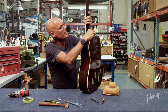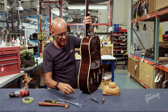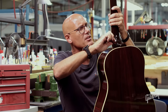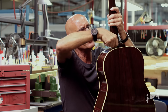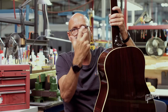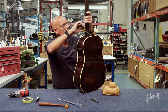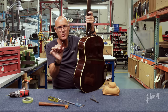Now we have it drilled out. We're going to remove that low-tack tape very gently, and now I have a countersink with a little handle on it. I'm going to gently use that over the hole to put a little chamfer on it, so it clears the way for that screw to start driving in without risking chipping the paint. I just do that a few turns. If you don't have that, you can improvise with the tip of a Phillips screwdriver, however a countersink is the preferred method.